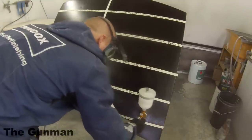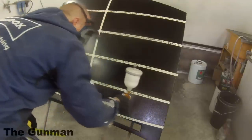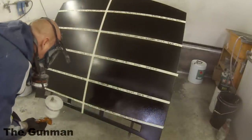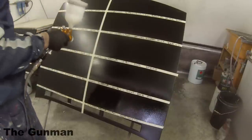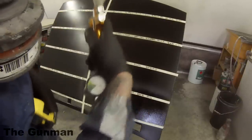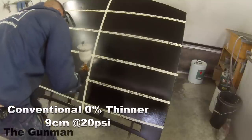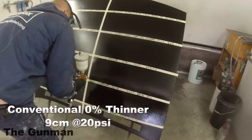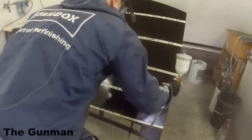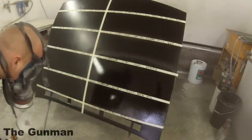This was actually very hard for me — it didn't feel right at such a far distance and such low pressure. You'll see we get very terrible results. Basically, 15 centimeters is way too far away. It probably couldn't hurt to get a tape measure out and measure your distances. The gun settings I'm using are full fan, fluid set to four turns out, and I'm leaving those settings for the entire demonstration — I'm only changing distances, air pressures, and thinning ratios.